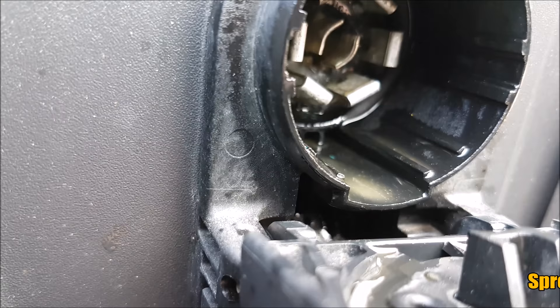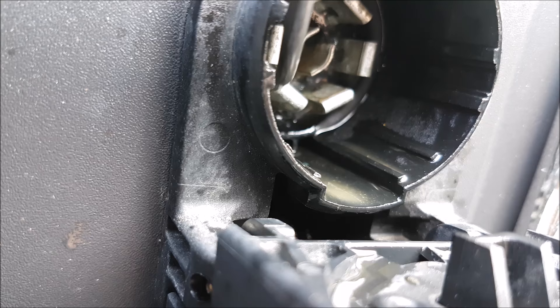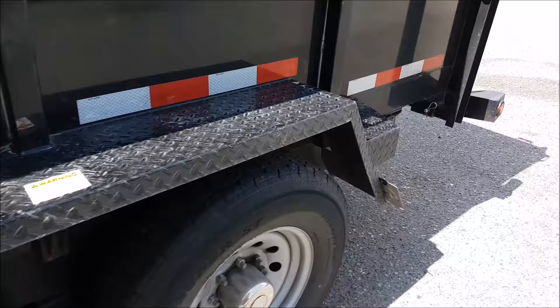The final thing I'm going to do is spread these pins. Keep in mind you can't do this too often. You can see the pins are like a spring, and if they're too close together you're going to get a poor connection — it's not going to be tight. What I do is take a pick and make sure you only touch one pin at a time, because you don't want to short two together. I'll spread them out so they grab onto the plug much better.